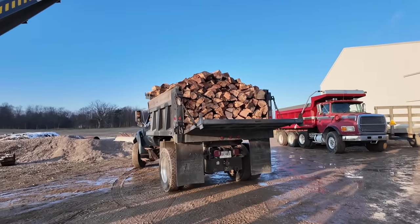We're about at the right timing for a new chain. We went through some really hard logs — those little short ones that my cousin Alex brought were really hard — and we're through those now. So we're going to switch out chains and then it'll cut like a champ again for a little while.